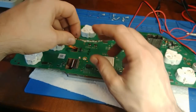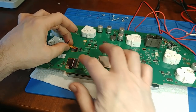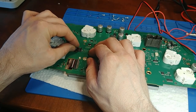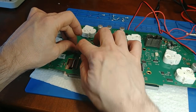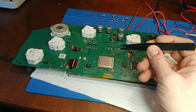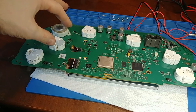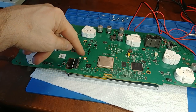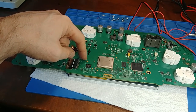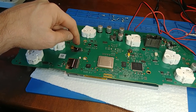I've cut off and reused the original ribbon wire from the original LEDs and soldered them to the new LEDs. I did run into a problem with my original measurements: when testing the LED power supply I was referenced to ground. This little copper area is tied straight to ground, and I measured from ground to the positive side of the LED drivers — that's when I was getting 18 volts.